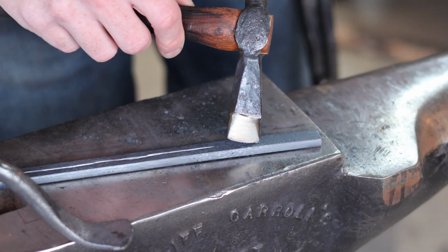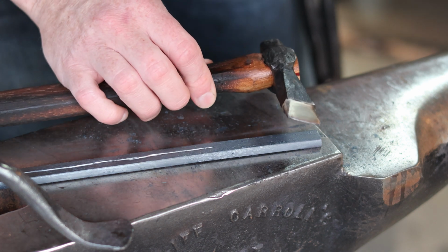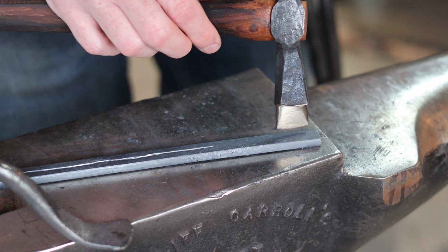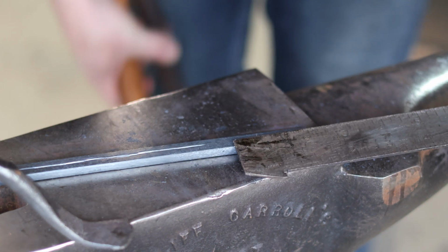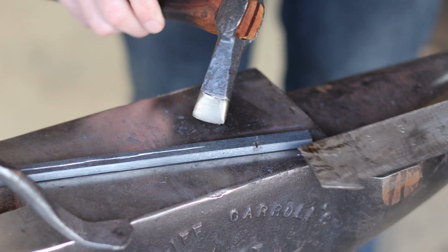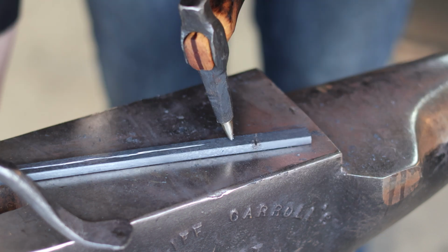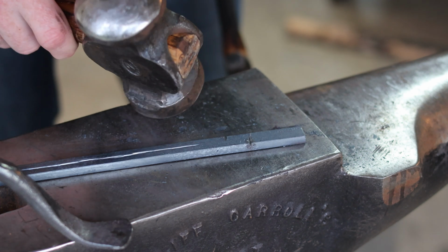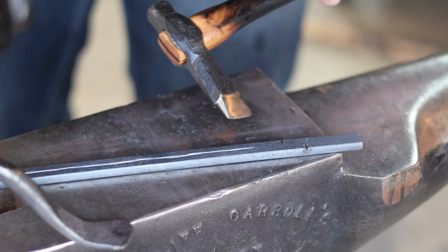Now, the plan here with the jaw is to chisel halfway into the bar to kind of where that center line would line up, and then twist the jaw outward away from the main body of the parent stock in order to create the jaw. And I know this is a piece of 1/2 inch stock. I'm going to chisel halfway up from this far edge to the center line. From that current chisel mark, maybe a little bit more than 1/2 inch, and that will end up becoming the boss. And that gives me a point to chisel this center groove to before I end up cutting through my boss as well. Now I'm going to do that on the other end, and I'll meet you back here in just a second.